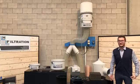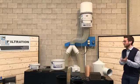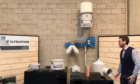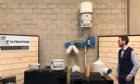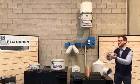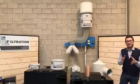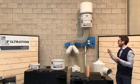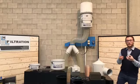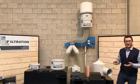So another question we often receive is how can we check when it's time to do maintenance? So how can we check the status of the filter? How can we check the lifetime of the filtering elements? So yes, of course you can always do a visual check. Okay, so you can feel, you can understand that the airflow is not enough. Of course, you can see visually from the machine tool what is happening. So it means, of course, that the panel has a lot of oil inside. So of course there is less airflow, there is less hydraulic head.